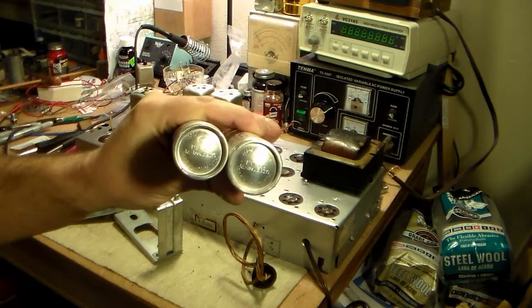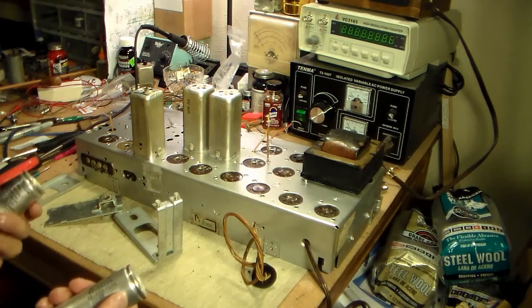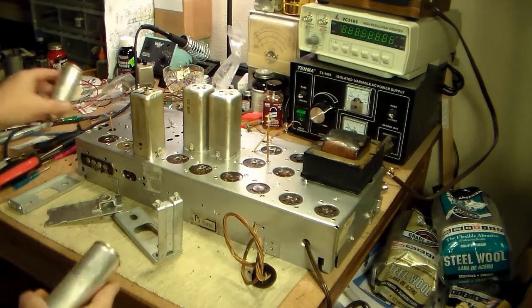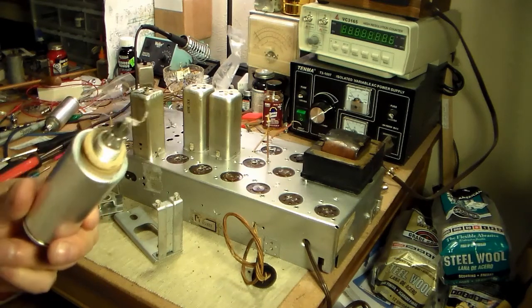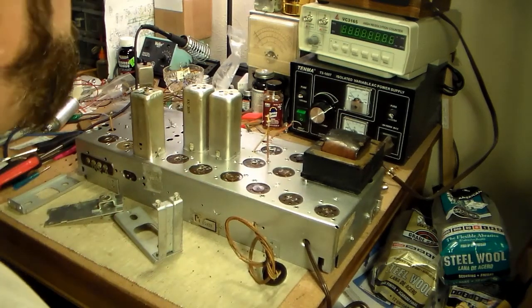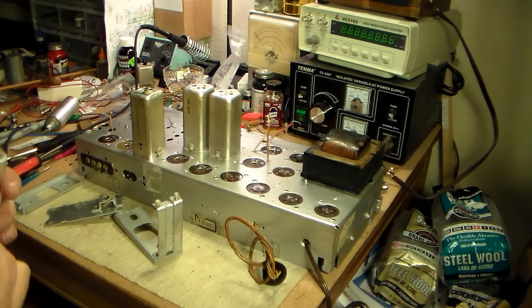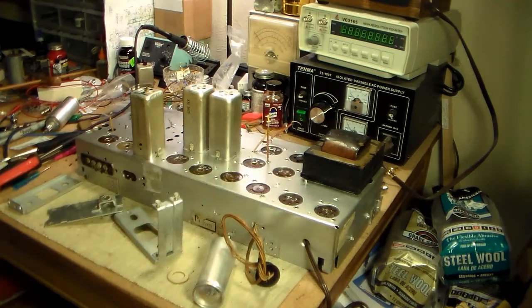Just so you guys know — I know that Sprague made Filco's caps because if you look at the top of these, they have the same patent numbers on them, so I'm absolutely convinced that's who made their caps. The other thing I discovered — in case you hadn't noticed — is the reason why this was left on is because it's a floating ground. These are fiber boards, not cardboard. I'll be putting that back on when this stuff hardens up a little bit more.